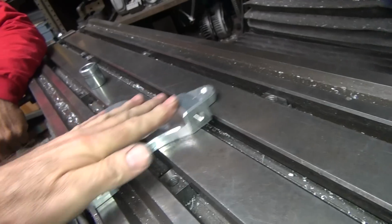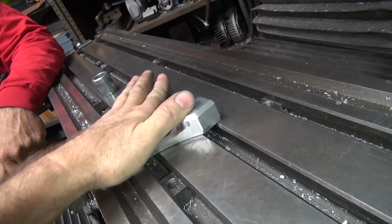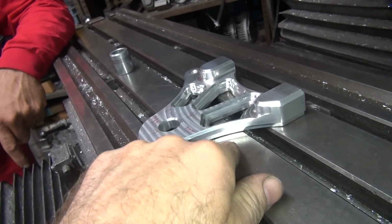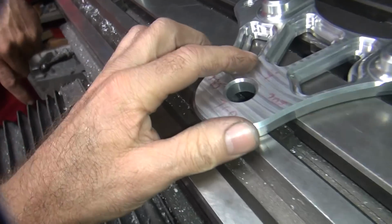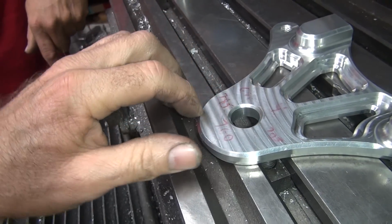We go like this. You hear it's pretty flat. This way, not too flat, it's dropping into every little groove. So there's your test. When you lay it on the flat surface here and you run a feeler gauge under there, it's 9 thou out. Now the other thing we had, 8 thou variance between here and here by a mic, caliper. And every one of these little marks you can feel.